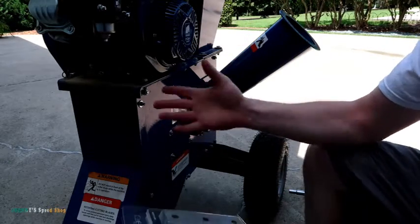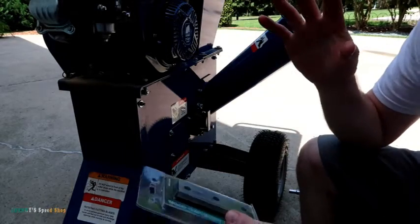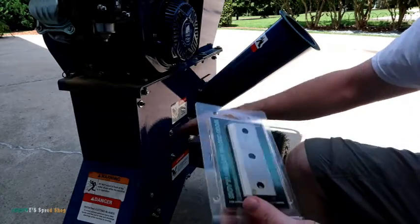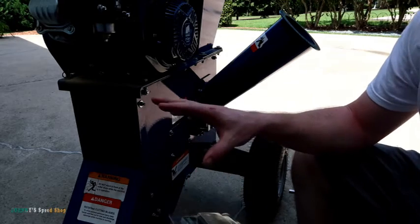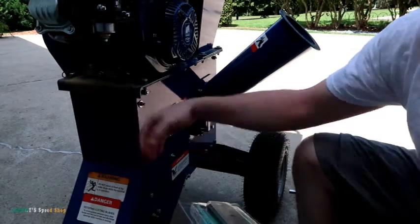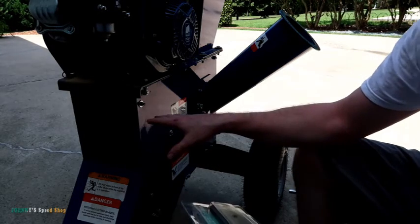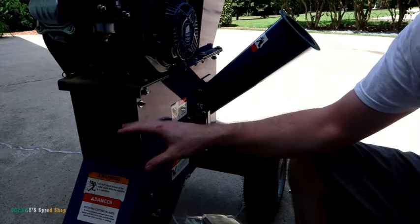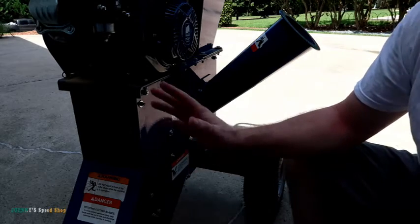This set's about 3 years old. It's done a lot of work, so this is a consumable item. I did look at the instructions on how they want you to replace these, and it's actually pretty bad. They want you to pull this little cover off, this little door here, these 410 mils, there's a little door there. There is zero room to work, and the nut is on the inside, and there's an Allen key on the face of it. So if you were to try and turn that Allen key, especially if they've been sitting there for 3 years, you're going to just round it out. It's pretty soft metal. So you want to loosen the lock nut side of it and just hold the Allen key. Well, how you would do that with this little door open, it's impossible.